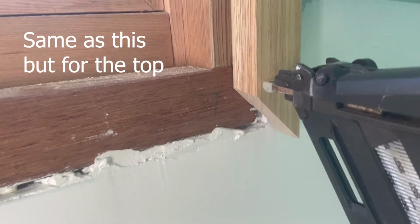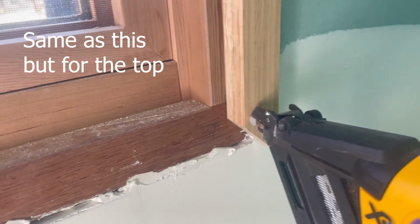Okay, so I struggled filming this next part, but what you're going to do now is hold your architrave up next to those quirk marks that you ruled. You're going to make sure that it is meeting up with your top and bottom quirk marks. And once that's true, you get your gun and you fix the nail on the top of it.